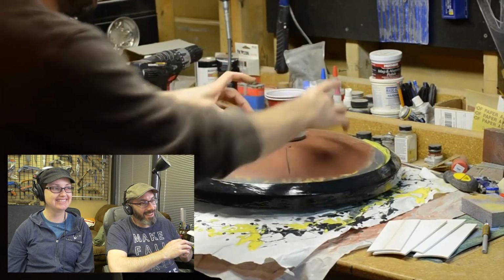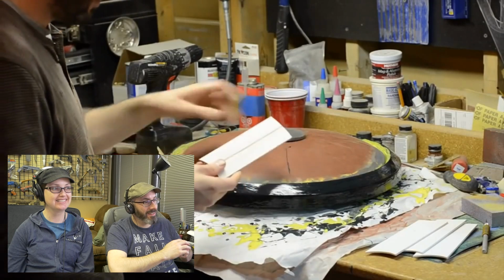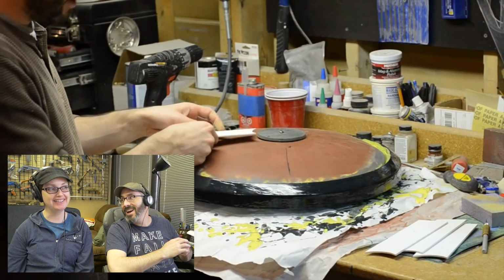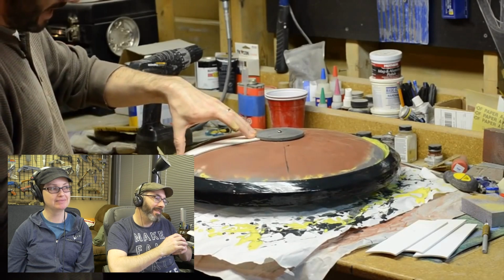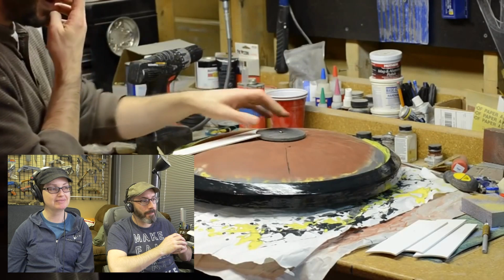And then for the cross pieces there, I'm cutting these out of 1/8-inch PVC. It's the same material, it's just white. I cut those out on the scroll saw, circle piece at an angle so that it will fit right like that. And then I can heat this piece and bend it down to shape. All 4 of these will be added to that.